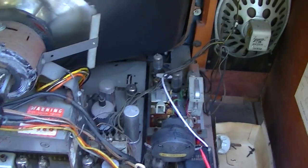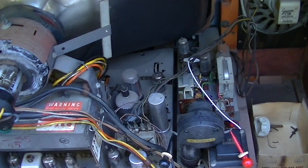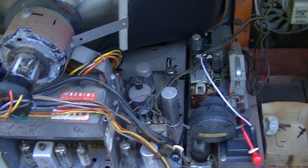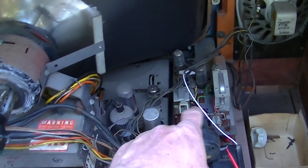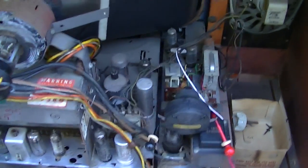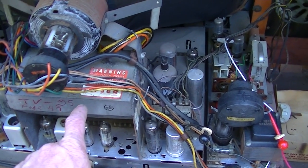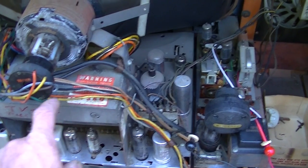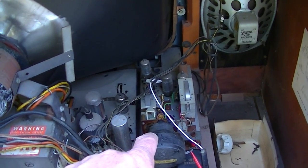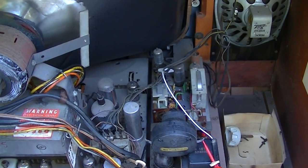You know, there's a couple interesting Zenith Robert Adler interviews. He's the one that invented this. On YouTube, I think I'll include one at the very, very end of the video, a couple of these old commercials, where he talks about developing this and that the frequencies have to be a certain frequency, because you have to keep in mind that the flyback is screaming along at 15 kilohertz, or 14 kilohertz, so the harmonics of that can't be picked up by this. So the frequencies this picks up are very well selected, I'll just put it that way, specifically selected.